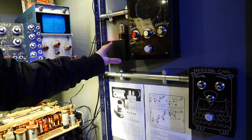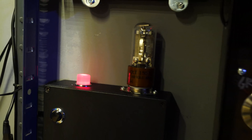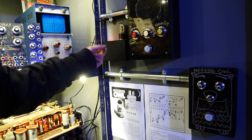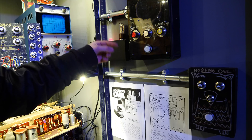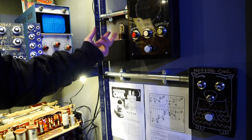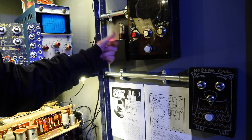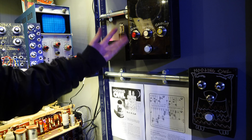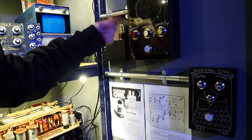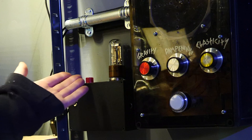So that is the delay relay — how thoroughly interesting. It hasn't quite turned off yet, but whilst I was building this I actually found a really interesting YouTube video on delay relays — the link is below. It's by a fellow who actually made an astable multivibrator with these delay relays. One of them was a normally open style and the other was normally closed, and when they were put together you could actually make both of them turn on and off. I thoroughly recommend you go and watch that video. Oh, it's turned off now.